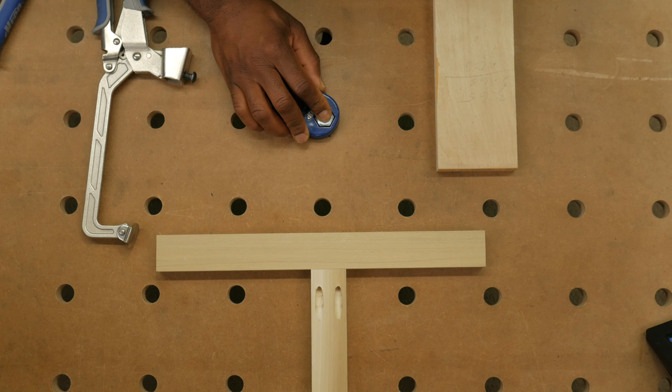Because of the size bolts they use, you can use it with their bench — but I'll give you a heads up on that. You can't use it on their workbench everywhere, because it's plastic. Especially if you're using it for face frames, because your holes are going to bow and it's not going to hold the pieces perpendicular to each other.